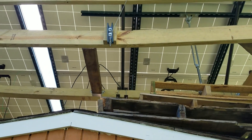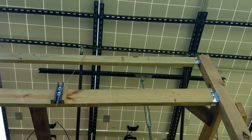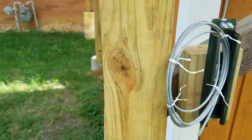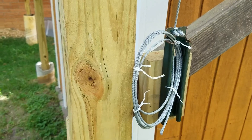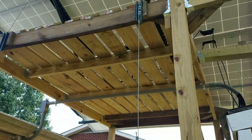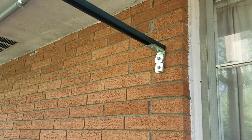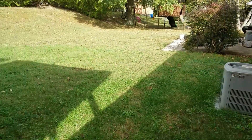As a safety precaution, I have this steel cable tied down here, and it goes through a couple of eye bolts attached to the unistrut and back down for the second tie point. I have extra cable for when the tilt goes to the more winter angle — you loosen it, pull it through, and clamp it down again. I've also got cross beams for structural support, and angle brackets attached to the house to prevent any sway of the poles.